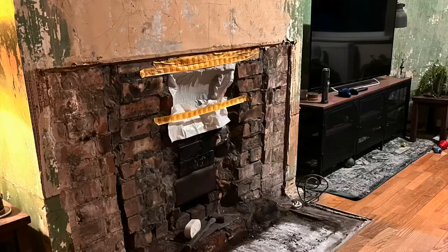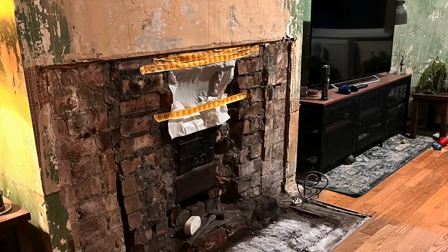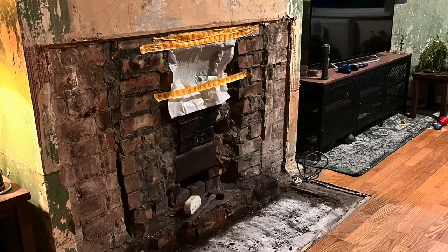I've done a few bricks - probably about half a dozen. Speed five seems to be the sweet spot for these kinds of bricks, which are just pure concrete. Four wasn't really doing much and it took a while to get the first couple off. There's a lot of dust, so definitely wear some proper boots while you're doing it because you don't want a brick to land on your foot. When it starts to come off, go to manual so you're not using a really powerful tool when it's already shaking loose - so the brick doesn't fly off. It's actually working really well. All I did afterwards was carry on taking the bricks off and then a bit of slate off the bottom.